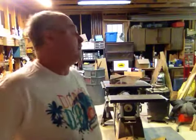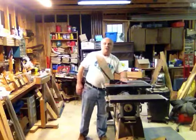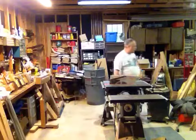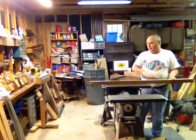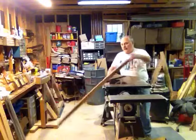I can't say enough good things about the Shopsmith. However, there was always one big drawback for me: the table saw. While the table is nice and wide and the infeed is good, the outfeed is disastrously short. You need an outfeed table with some length and some meat to it, because if you're feeding a piece of wood through, it needs somewhere to go. With a relatively long piece, you let go and guess what — it's going over.